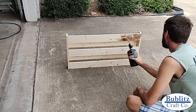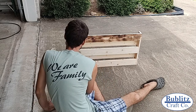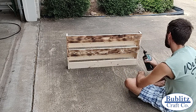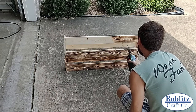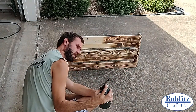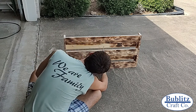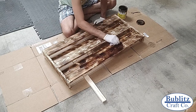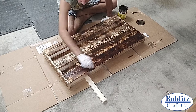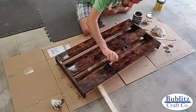The next step is a purely aesthetic one — it is not necessary and it's something I recommend you try when you are comfortable and ready. I personally decided I wanted a little more contrast in the wood grain of my piece, which is something that is common when working with pine. You will sometimes find that wood stain alone does not give you the varying grain pattern you might want. In this case, I chose to char my piece using a blow torch. A nice light charring across the entire piece will really make the wood grain pop. When it came to finishing the rack, I chose to use a Minwax dark walnut wood stain to get the color I was looking for, and then a Minwax satin finish polyurethane varnish to protect the wood from any dings and scratches.